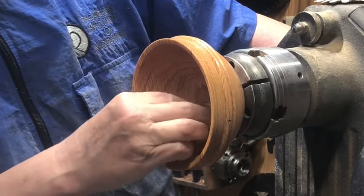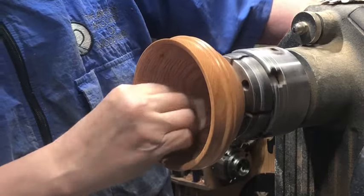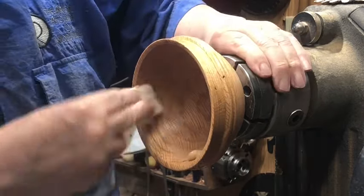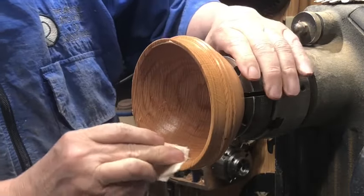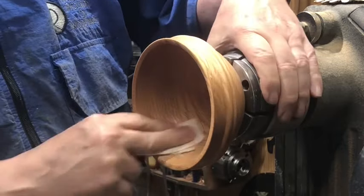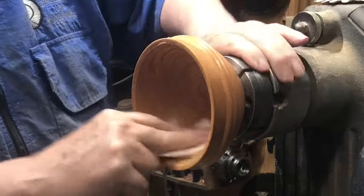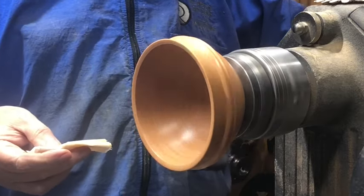I didn't show you very well. This is the abrasive paste going on. Same process. Just use my paper towel, get some on the paper towel and spread it around, making sure I've got enough to cover the entire surface. I have seen people who use just tons and tons of abrasive paste. That's fine. It just takes longer to get it off is all. You're not going to get any better results. You don't want to skimp on it either.